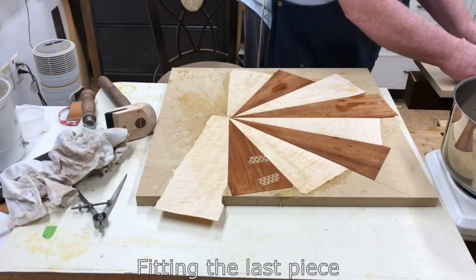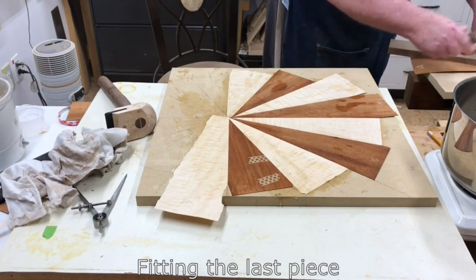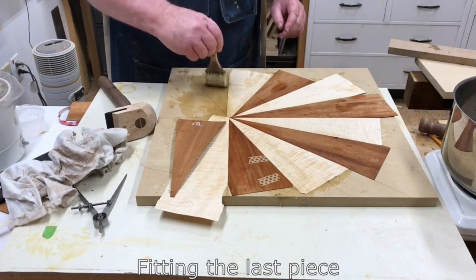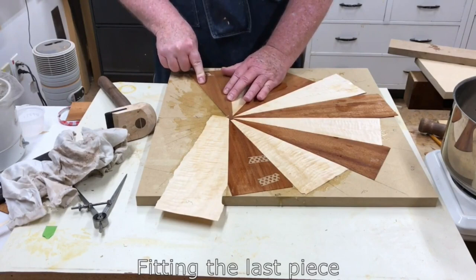So when I'm putting this last piece in, I probably want a half an inch of overlap. On the left side of this, so this glue is almost done here. It's totally thick. It's another example of how forgiving hide glue is. So I'm going to put this down. This is going to align with the piece of veneer that was over here. I'm going to make sure we're past the center line.